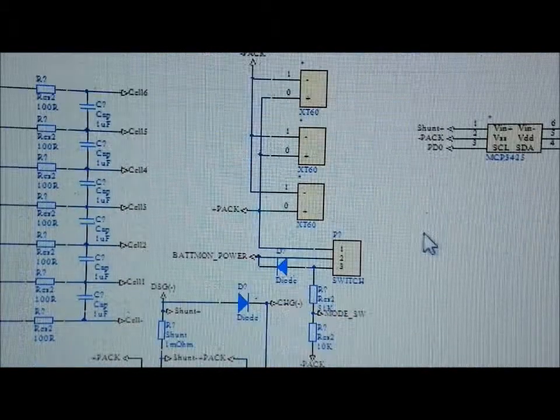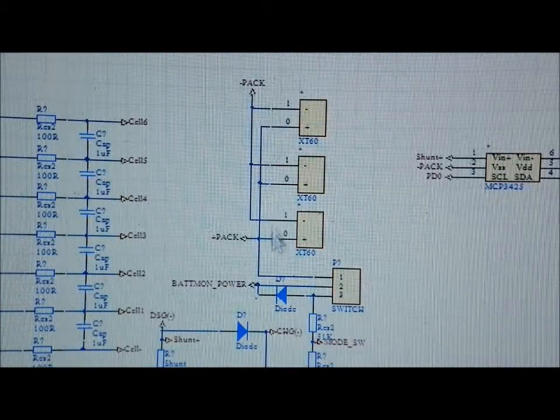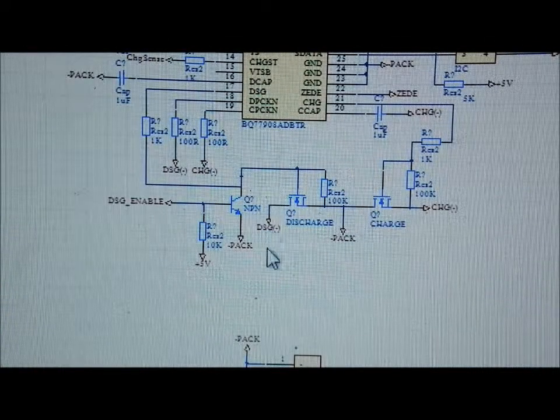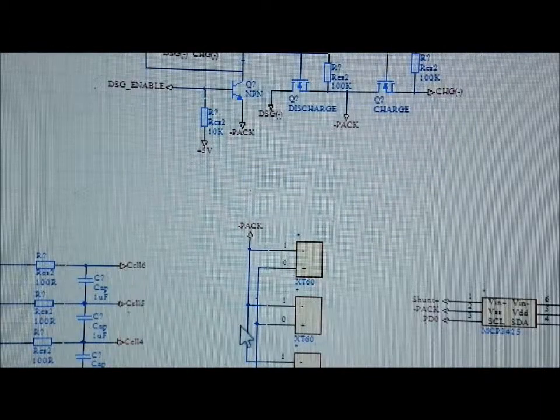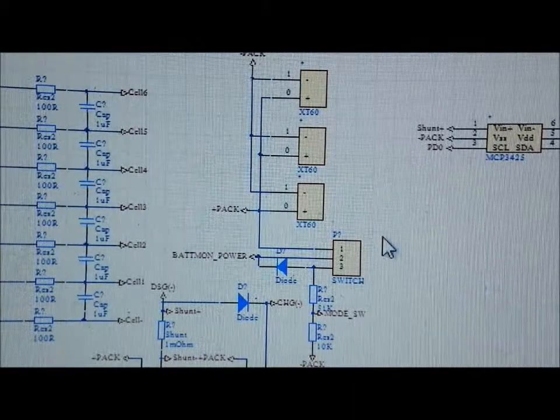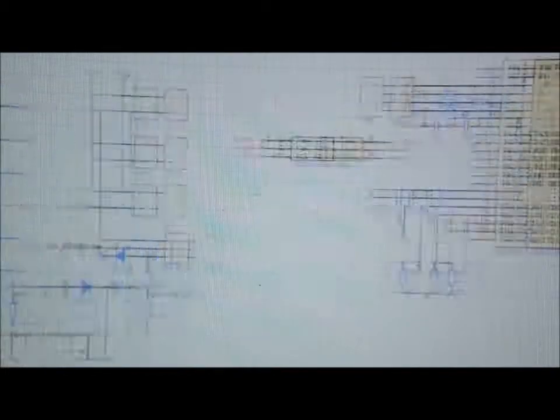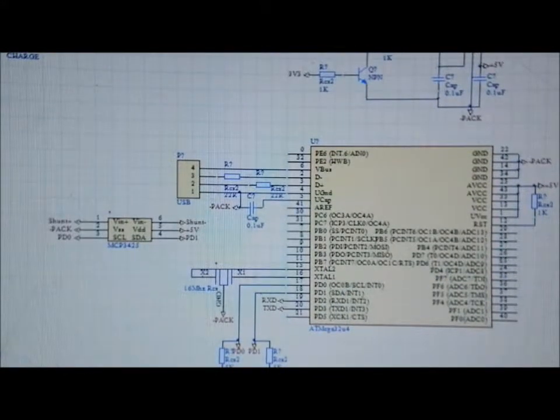The main high-current path runs through the connectors, either out to the motor or in from the charger. So the current goes from the inputs straight through the battery protection FETs, then out to the motor and everything else. The controller will also monitor ground speed, do calculations on estimated time remaining, and handle temperature monitoring. There are plenty of spare I/O pins on the microcontroller for all that. That's basically an overview of the electronics — thanks for watching.